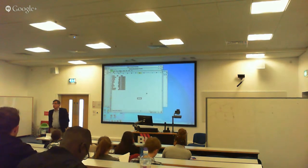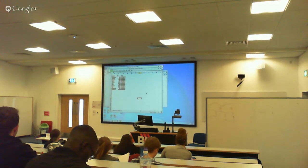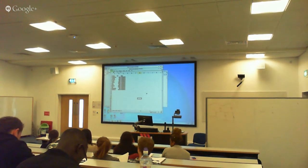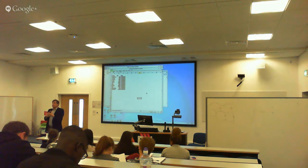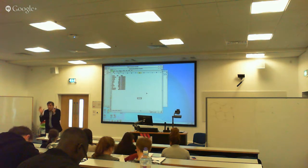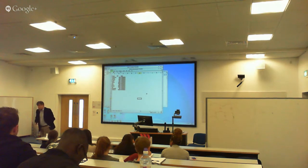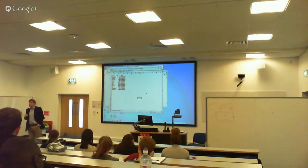What does crystallinity do to polymers? If you have a crystalline polymer and a non-crystalline polymer. Remember, you should know the difference between crystalline and amorphous, non-crystalline material. What's the difference? The answer is that crystalline materials have an ordered structure. The atoms have a particular order, a disciplined, set, regular position. They are set in specific rows and columns. When they have some degree of order, we say they are crystalline.